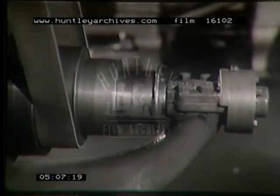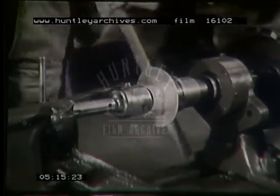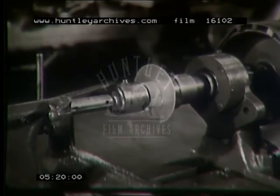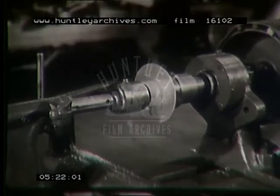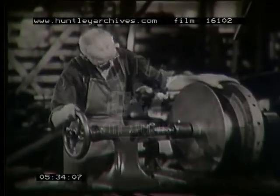The speed of your lathe is determined by the diameter of the blank and its thickness. Peripheral speeds for spinning aluminum range from 1,000 to 3,000 feet per minute. Normally, higher speeds for small, thin blanks, slower speeds for larger or thicker ones. Handbooks will give you a chart of suggested speeds, which you will want to adapt to your own experience. Here are some general rules which apply to all hand spinning.